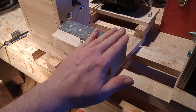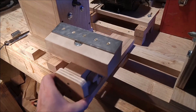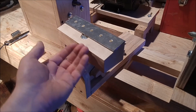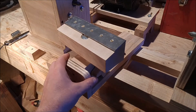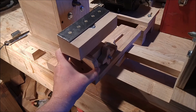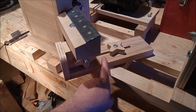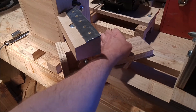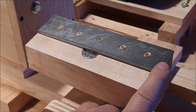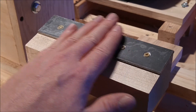This assembly is for supporting the chisels when you're running the lathe. There are two nut knobs: one for side-to-side movement of the carriage, and one for both pivoting and up-down movement of the carriage. There's quite a bit of flexibility in how you can position the carriage — for example, if you wanted to turn a bowl, you'd orient it accordingly. The bottom of the carriage is made of solid oak, which makes it very strong; when clamped down, it's not going to move. There's a 1½-inch wide by ⅛-inch thick steel bar screwed into the carriage that protects it from damage caused by wood chisels if they were to catch against the workpiece.